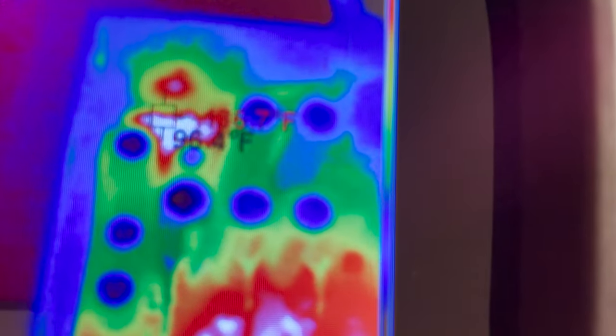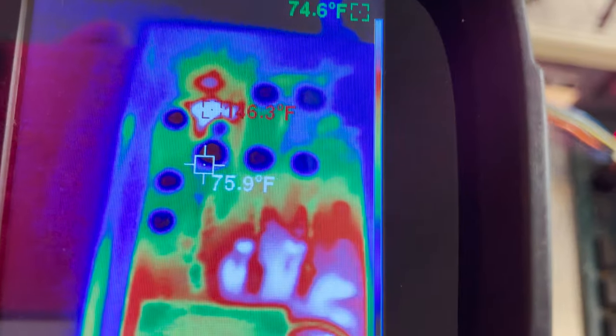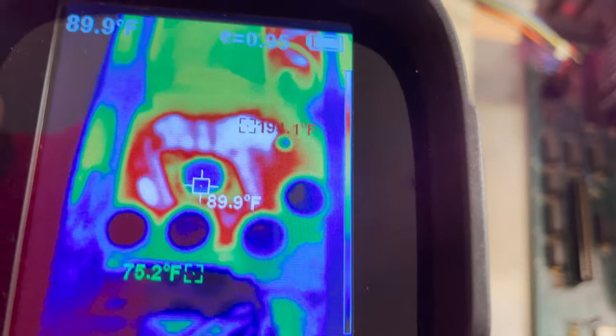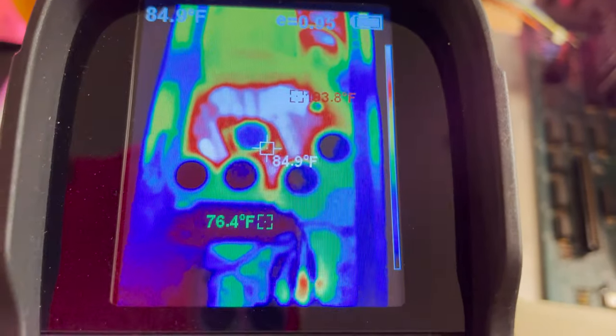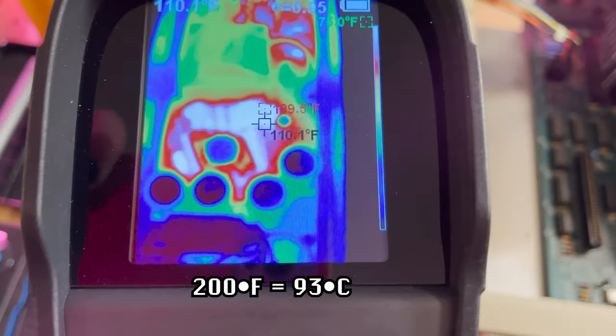The capacitors are doing fine, but behind the capacitor — which is actually where the wires join in — we're seeing temperatures in the 140s°F, which is not good at all. That little transistor component down there is rating a lot of heat — 200 degrees Fahrenheit. I will have to convert that to Celsius for the Celsius folks out there, but yeah, it's very hot.